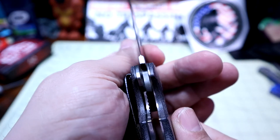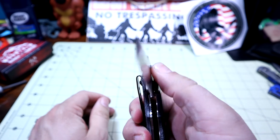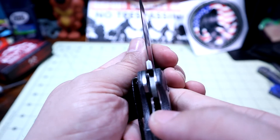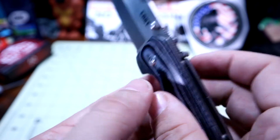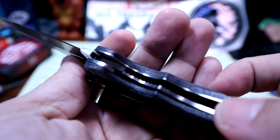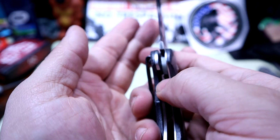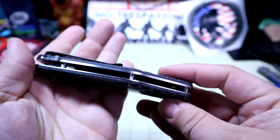The other thing is the lock-up. You can see right there — it doesn't really even lock up, and that's opening it slow. It's barely engaged, and that's really dangerous. If I want it to lock up more I have to really flick it open, and even then it's barely locked up. The lock-up is way early and the alignment is clearly off. This is one of the few examples where I can actually put in that extra piece to get it to lock in there — so now I have the double lock on. But usually when I push this forward I can't because it's not all the way engaged. Once I push that in it's really tight. Lock-up's terrible, centering's terrible — not very good at all.